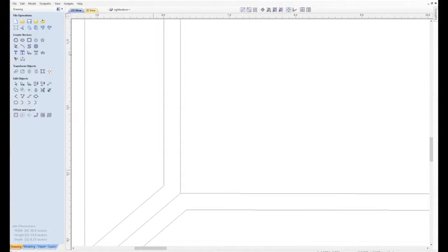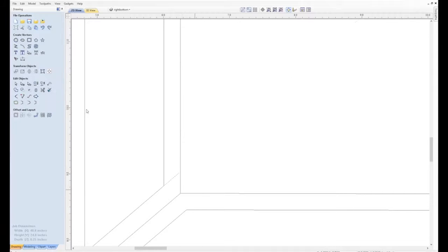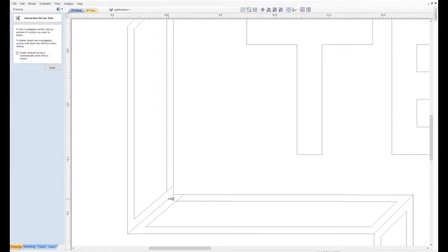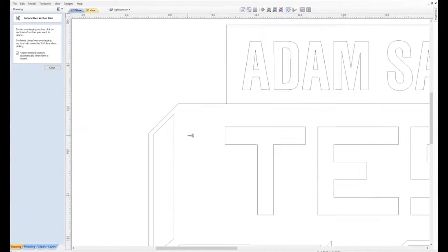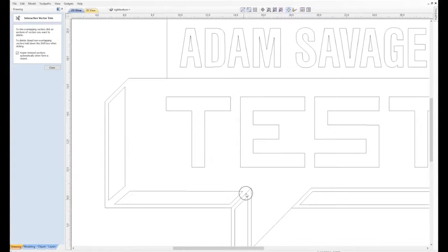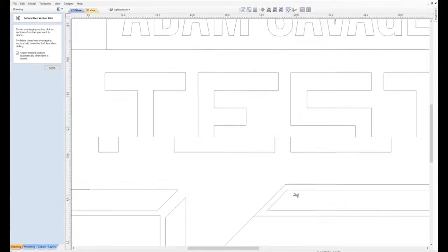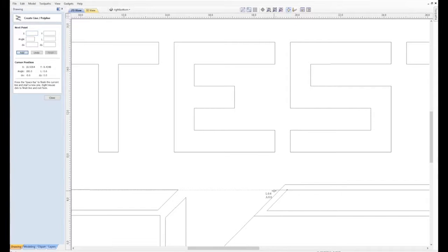Now if this were something we were laser cutting, the width isn't something we need to consider. Is that something you need to think about with plasma cutting? Plasma cutting — the width is important for your plasma torch and for your feeds and speeds and arc voltage. But the arc voltage is not set within Vectric VCarve; it's actually set in a plug-in from Mach 3, which is our control software. The feeds and speeds will be inputted into VCarve later during the CAM process.